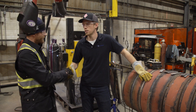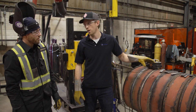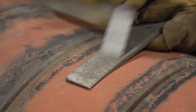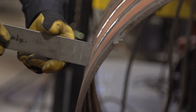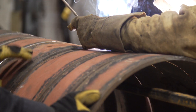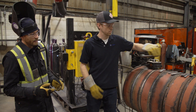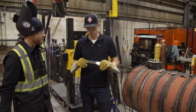Thank you for having us at Legion Piping Fabricators. When it comes to the spatter-proof wedges and the step wedges — fitting big bore, small bore — where are the advantages for you? I found them quite handy because for fitting, rather than eyeballing it, I could just say this is a perfect 3/32, 1/16, 1/8. And especially as it progressed down the pipe, it was slamming up tight a little bit as the weld progressed. The spatter-proof wedges were handy for keeping the gap uniform, and I don't have any spatter stuck to them when I need them further down the pipe. They're fantastic.